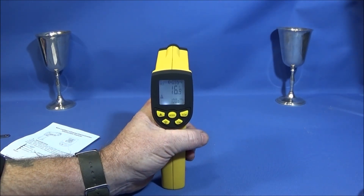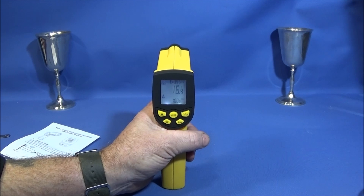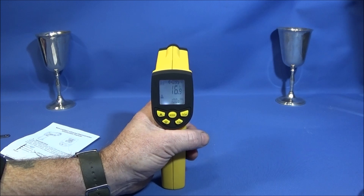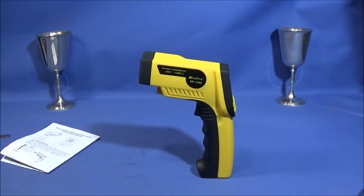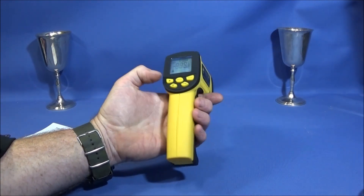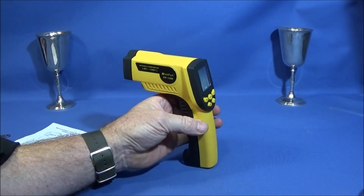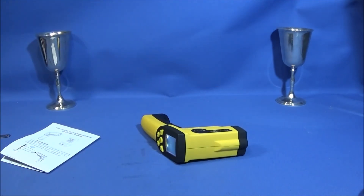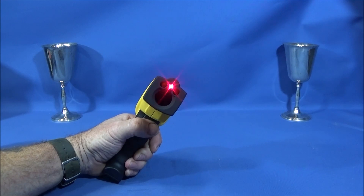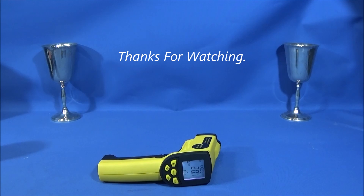When cooling tool steel I like to get the slowest cooling method possible. That's why I put a brick or something over the front of the forge when I've finished heating it, and then leave it for several hours to cool down naturally. I think it's an excellent thermometer to buy, and when you see the price of it you'll be quite surprised at how low cost it is. I'm really pleased with the performance and think it's well worth the money.